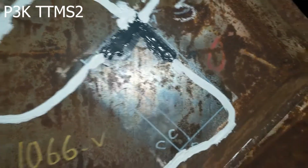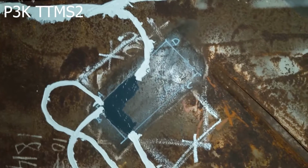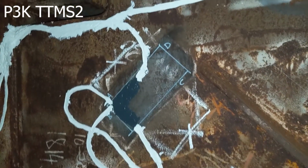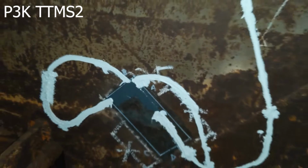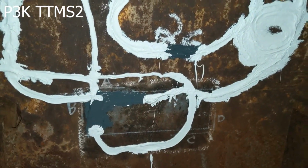All right, here is 23. Okay, it's at a 45-degree angle up. The fiber comes along here to 28 on the sidewall. And then we go to 24. Okay, and then here's 25 down here. Okay, 90 degree. We avoided this weld seam, as you can see, just put the sensor station up from that. And then you can see sensor station 26 with the associated temperature gauge right above it.